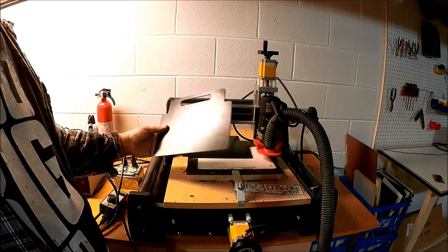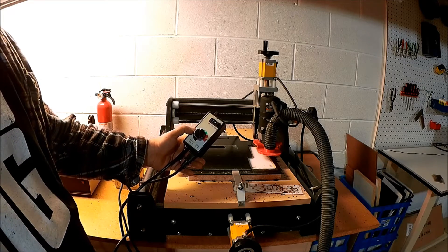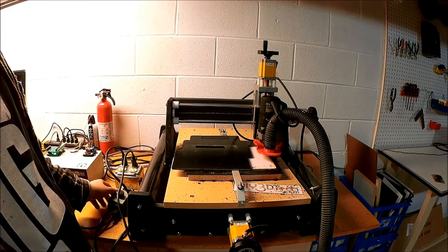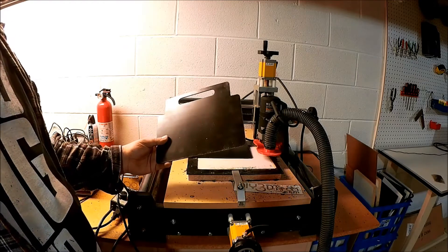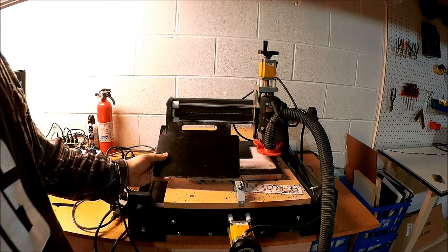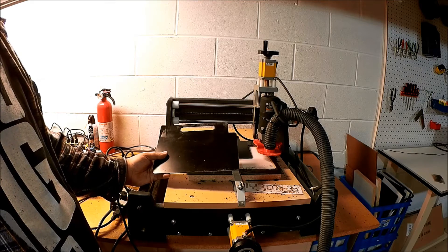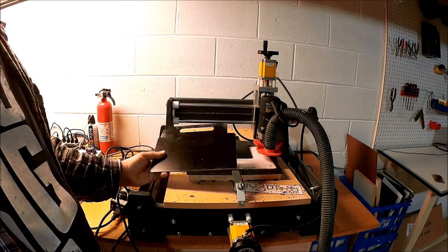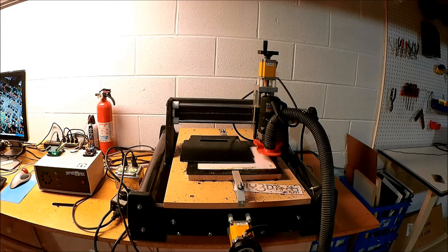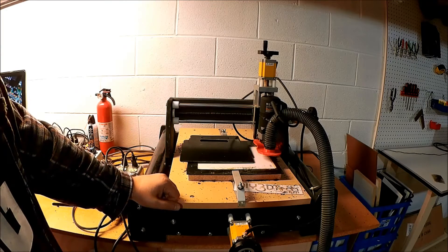What I did is I kicked up the speed a little bit. You can see where the tape is — that's when I was experimenting with four flutes. At two flutes, at low-medium speed, cutting about 100 inches per minute, it really came out nice. Although in the time-lapse video you'll notice some challenges — I think Grbl crashed or something crashed and stopped. The PC sending the commands using the Grbl controller just seemed to finish but the commands weren't buffered, so I re-ran it again.